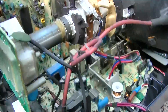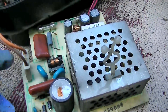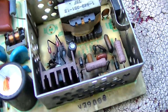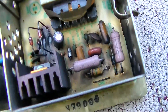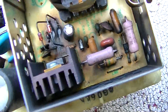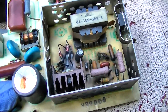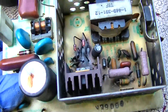So this is the power supply board. This down-converts the AC line to 12 volts. I'd have to rewatch the previous video. The Zener diodes we changed were in here — these two. And wow, is that baked. I upsized them. Something looks like it popped in there. I told him to turn it off because this power supply just sits and runs and just bakes. Look at that — that's why I upsized the Zener diodes and stood them off the board.